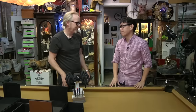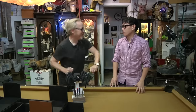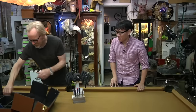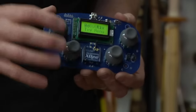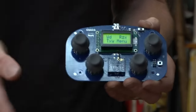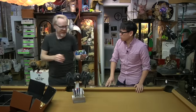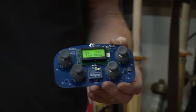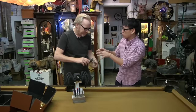There's a ton of calibrations because the board expects each leg to be in a specific place. When I had two servos out of alignment, the spider's bottom would droop as it walked — you'd get this sort of accretion of error. At this point I've got it running at about ninety percent, and you're not going to notice — it's gorgeous. So here's the controller: it has four joysticks. One is for walking; one is for looking up, down, and side to side; and one moves the body and legs side to side.